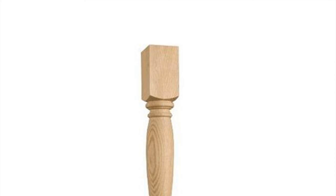Step 5: Return the metal plate to the chair frame, lining it up with the marks on the frame that you previously made. Then insert one of the screws into one of the starter holes you made and screw it into the wood using a screwdriver. Screw in all four screws to complete the project.